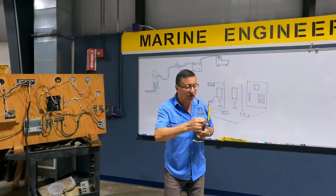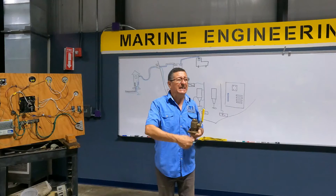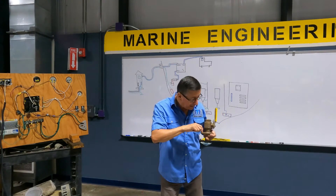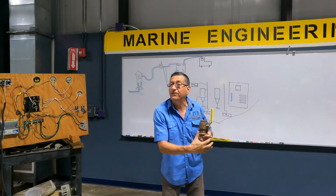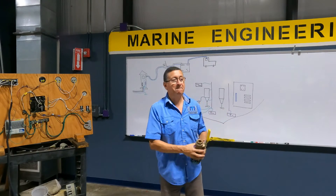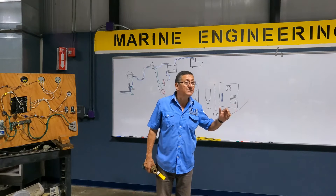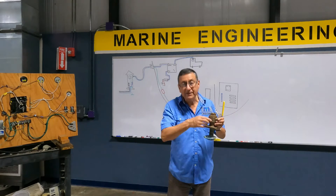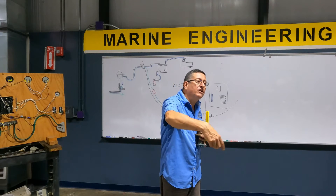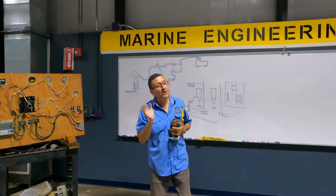This through-hole is connected to that bonding, and now in this through-hole four volts are flowing constantly. What happens if I have my boat connected to that shore power for two weeks? Fully corroded — and if I have bolts in steel, aluminum, copper, and different metals together, in one moment this metal is eroded and perforated. Water enters, and finito. During the weekend, after inspection, the insurance and inspector found two through-holes perforated by corrosion. They found one cable touching the block of the starboard engine constantly positive — that cable produced the four volts. They discovered that the problem was over there.